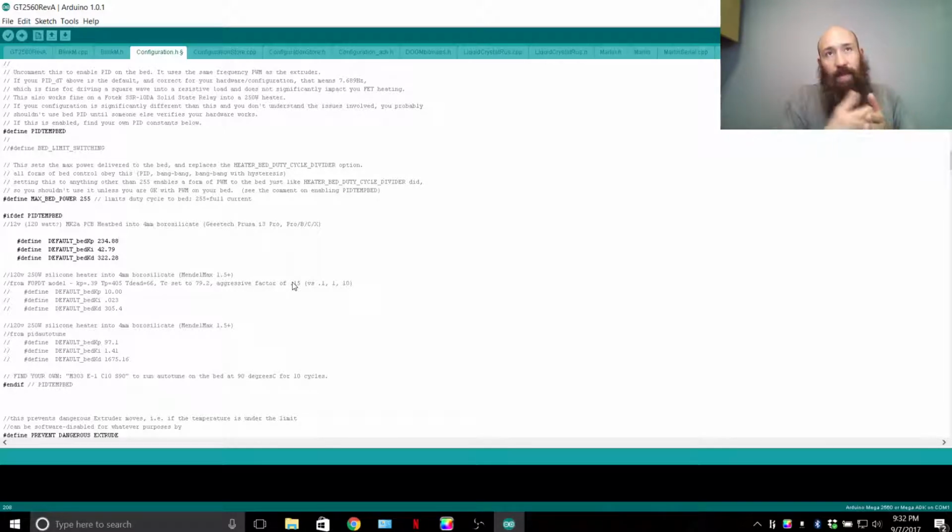When your temperature hits, it shuts off the power, but your temperature is going to exceed that point because more power is fed to it than needed. And as that power draws back down, it'll pass your target temperature, and then when it gets to a few degrees below, your heater will kick back on full power, and then your temperature is exceeded again, and then it shuts back off, and it keeps doing this and keeps it within a certain range of temperature.